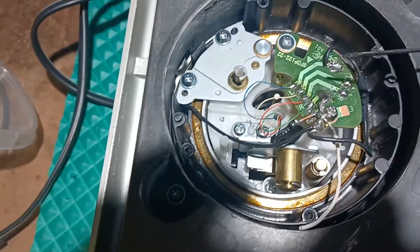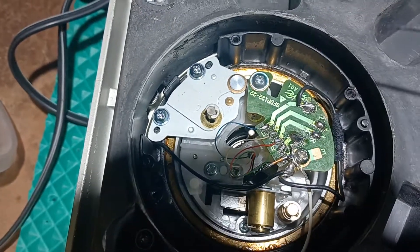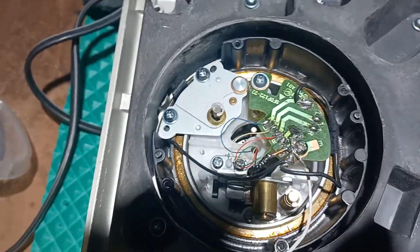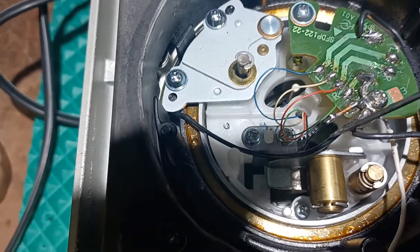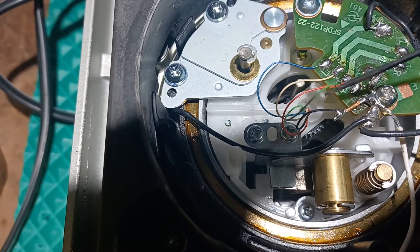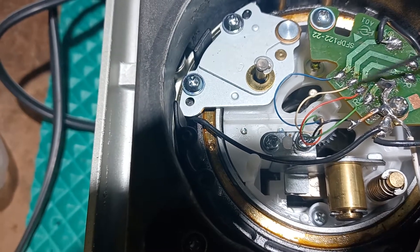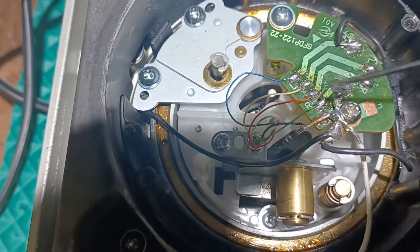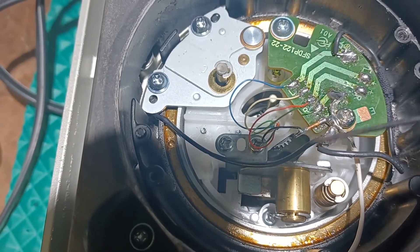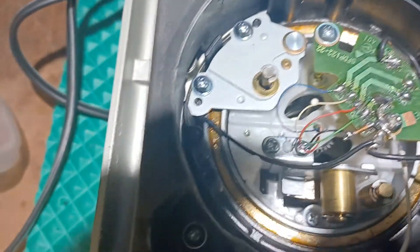This turntable had somebody do an internal ground job on it — there's a lot of theories about whether or not that's a good idea, I'm gonna leave it in place. But nine times out of ten the issue is gonna be with one of these incredibly dinky thin wires, either being broken, a busted solder trace, or them somehow shorting into one another. That was not the case here, but when I metered it, my red wire was shorting to blue.